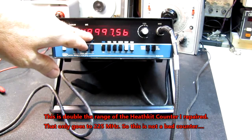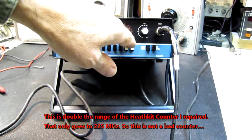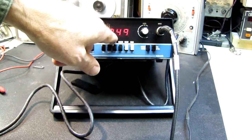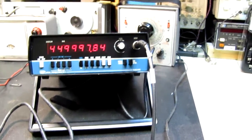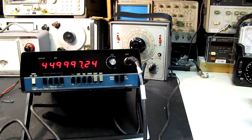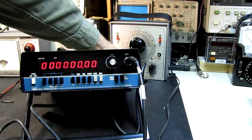So this would be 450.997 — you think of three more decimal places past the decimal point. An odd frequency counter, but it will work. Let's hook this up to our little restored signal generator and see if we can get it to accurately display 455 kilohertz. I'm going to shut off the old noisy Hewlett-Packard and warm this guy up.